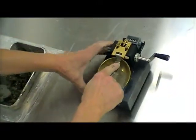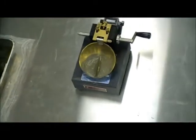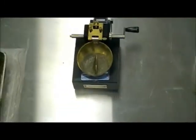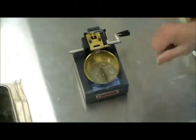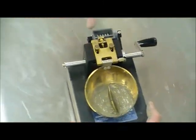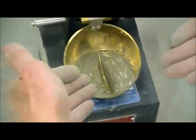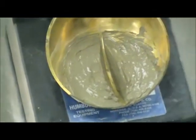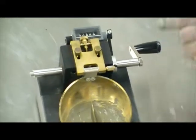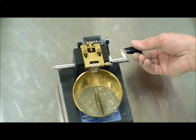We have cut a groove and we can see through the groove down to the metal. The idea here is we're going to zero the counter and start counting the number of revolutions that it takes for that gap to close for a distance of half an inch. The procedure is to turn it at approximately two revolutions per second, steady, and the counter is going to take care of the numbers.